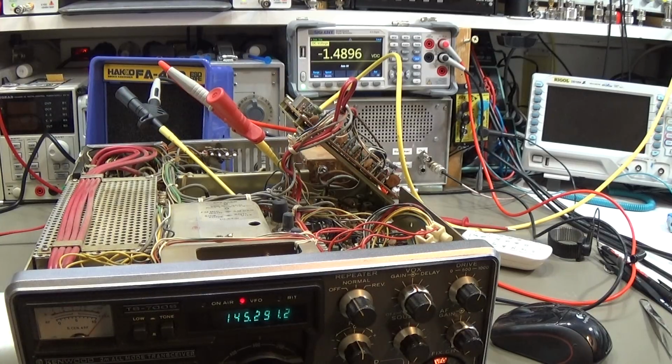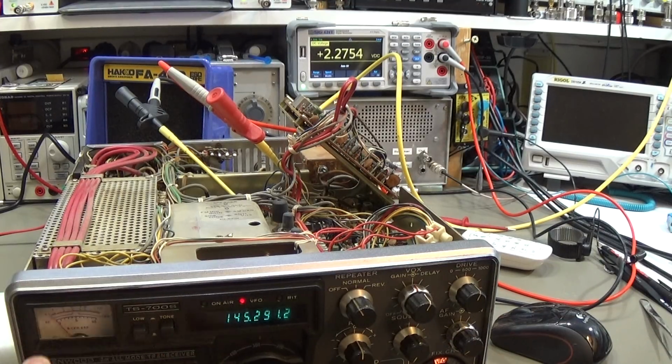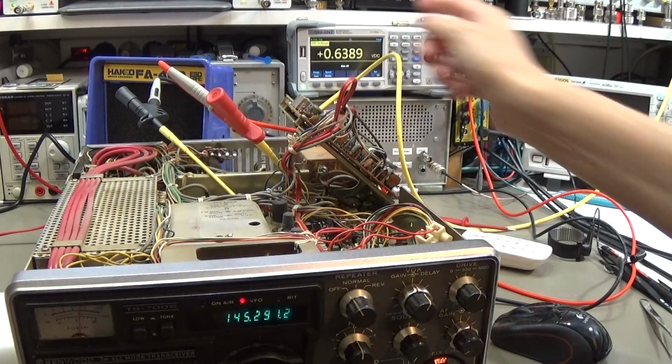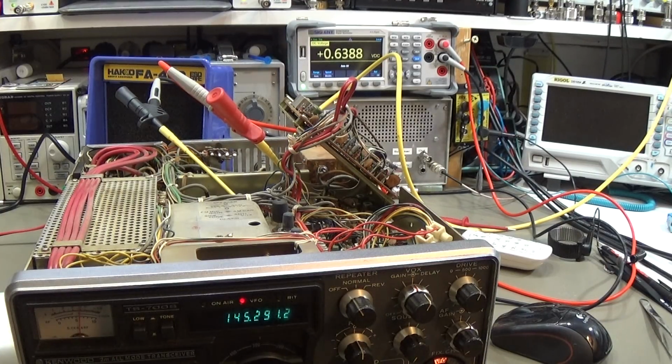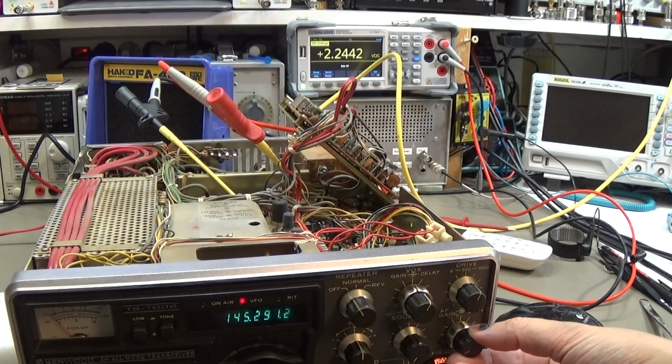And that clearly shows that we really have reduced our sensitivity to a max, and that means no sensitivity any longer. So what we know up to now is that our meter is working electrically and mechanically. We know that we are able to change obviously our AGC voltage, and by changing our AGC voltage we see that our voltage is changing and the sensitivity is changing. So that all is telling us that it is working fine, but still we do not have an indication with a signal, which we have of course, and you hear it is a very good and clean signal.